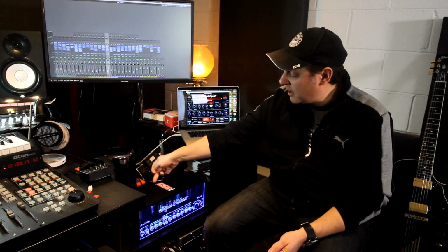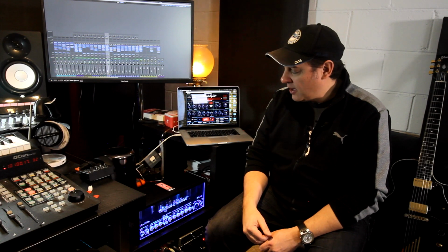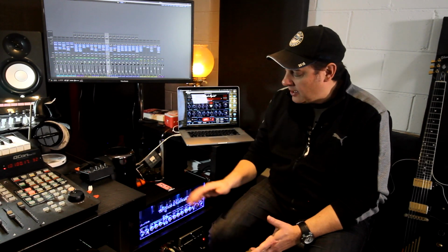So actually, that's been my preference because I do just have a mic cable. So I'm coming out XLR into my interface, which automatically sets that to mic level. It gives me a little bit more headroom going into the interface. So I'm quite comfortable using the mic input setting for the amp, and that's working well for my sessions.